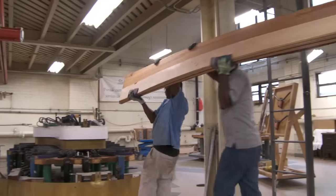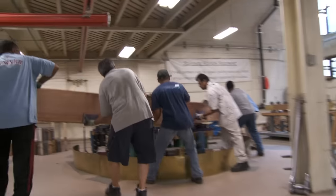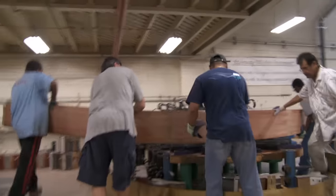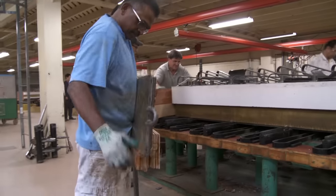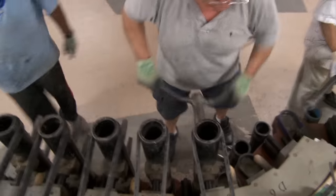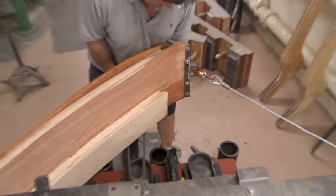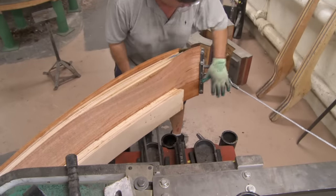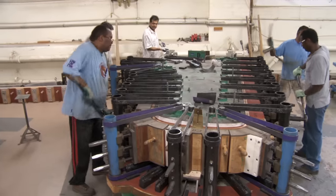The sets of maple, about 20 feet long, are carried to the press and clamped into position. The press, an invention of C.F. Theodore Steinway, was patented in 1880. They work around from the center outwards, tightening the clamps. What results is a homogeneous foundation of unified inner and outer rim, capable of standing the tremendous tensions of stringing.